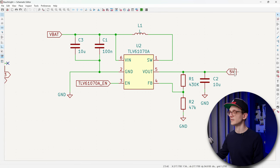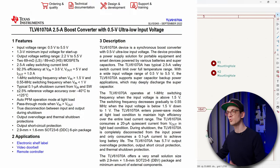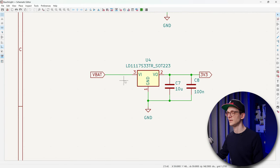I wanted to connect any voltage source and without any problems have 5V at the output with a minimum of 1.5A. The reason for that is because the strips get quite long — they have at least three, if not four LEDs per LED chip, and that sums up to quite high amps quickly. This is a Texas Instruments boost circuitry with a coil — quite efficient. The other components handle the level conversion between the 3.3V signal output of the ESP and 5V, and then there's a linear voltage regulator to convert from the battery voltage down to 3.3V for the ESP.